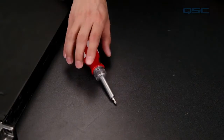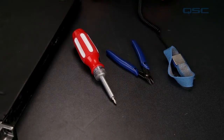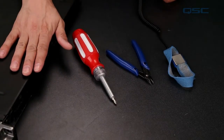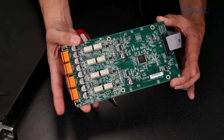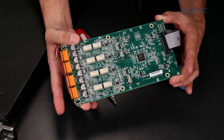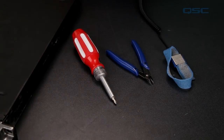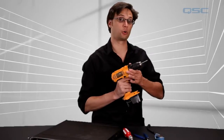The first step is preparation. You'll need a screwdriver, some small wire cutters, and an anti-static wrist strap or an anti-static work mat. If you don't have access to either of these, be sure to occasionally ground yourself by touching the chassis to dissipate your static charge, and only handle the circuit boards by the edge. This will provide a minimal static safeguard, but using an anti-static wrist strap is recommended. If you're using a power screwdriver, be sure that it's set on a very low torque setting.